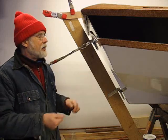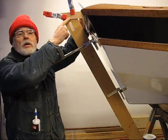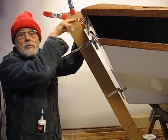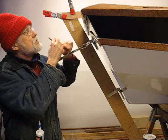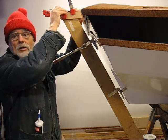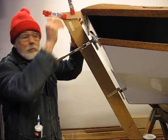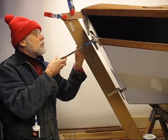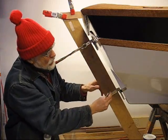Three-quarter inch would be heavy enough even on a 14-foot boat. I'll stick in a board long enough — I've got a bit of a tiller in there — and I'll set my bottom clearance for the bottom of the tiller. I'll put a mark on this scrap piece of wood, then come up to make certain I have at least an inch and a half to two inches above that mark, and then I'll mark the location of my pintle on both sides.